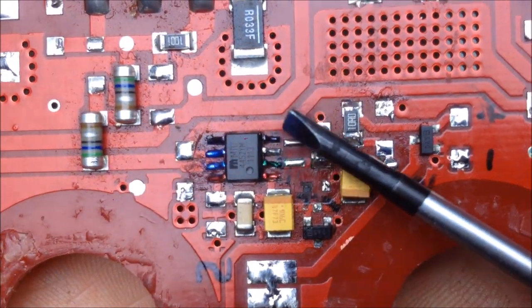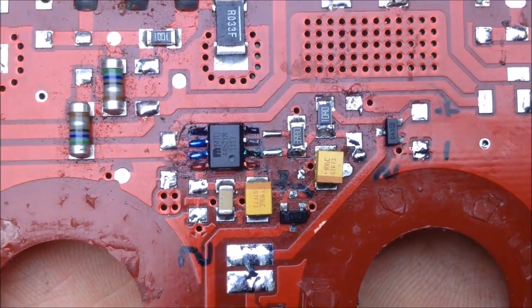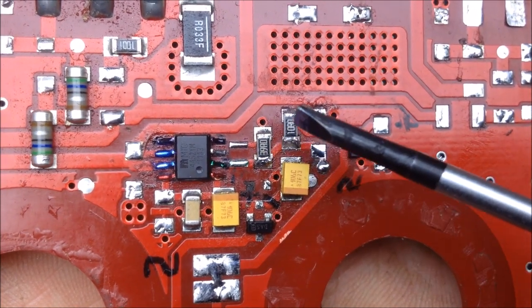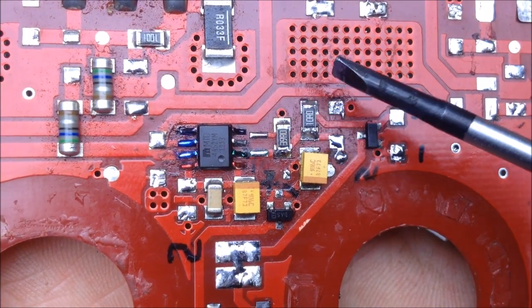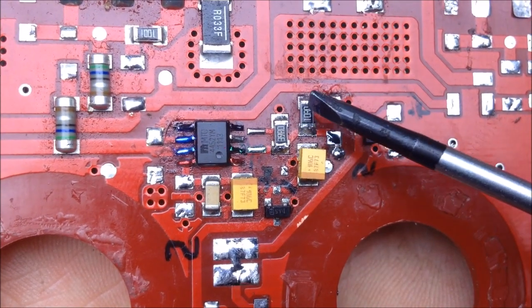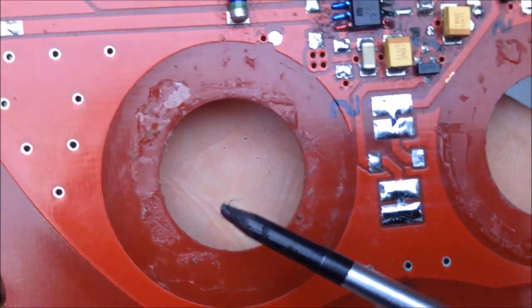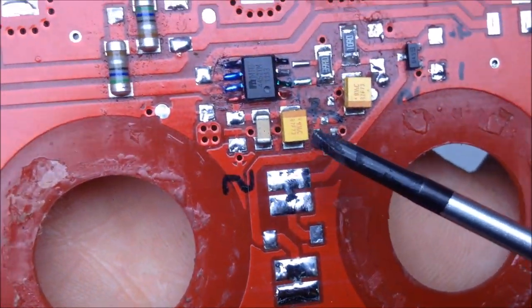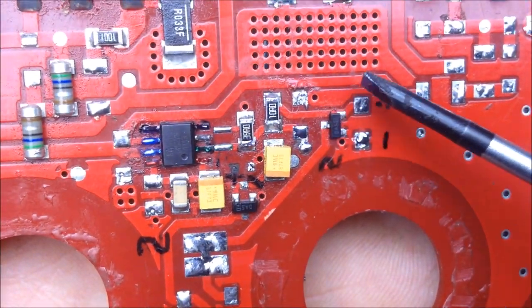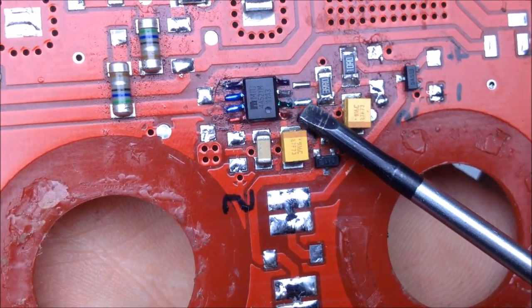I have colored those pins of the gate drive IC. These are 12-amp gate drive ICs, so they're pretty powerful. They are pulled down to ground — you've got a pull-down resistor here to the ground plane. And then you've got the signal, which comes off the positive leg of this diode. So when these get energized, they not only feed power to the gate drive IC, but they also trigger the positive signal to go through here, and that positive signal gets smoothed and then fed into the input.